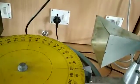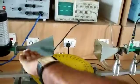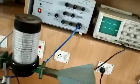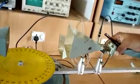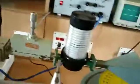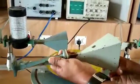Notice that this particular setup has been done in the horizontal plane — that means both antennas are on the horizontal plane. We need to repeat the same procedure on the vertical plane. This is the horizontal direction, and this is the vertical direction. If you do the procedure for the vertical direction, we will find theta-H after you plot the graph. For finding the vertical plane, the procedure is slightly different, so let us demonstrate that as well.